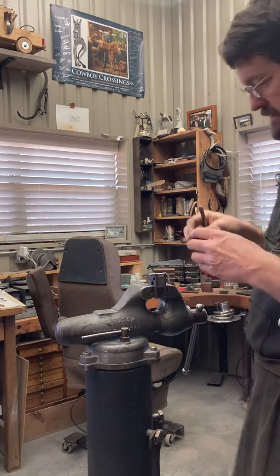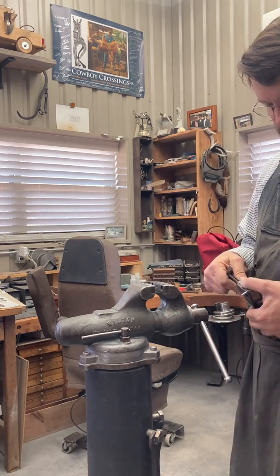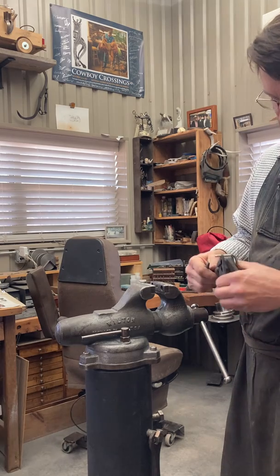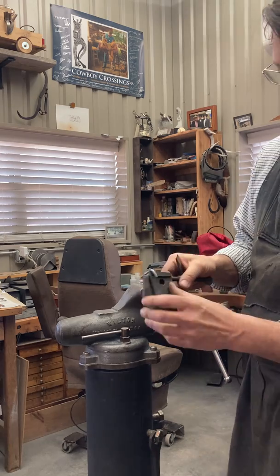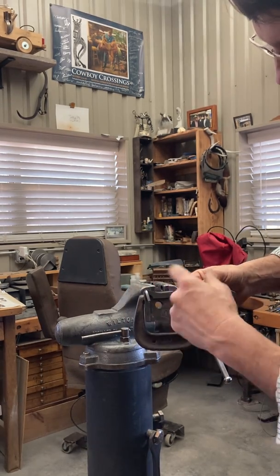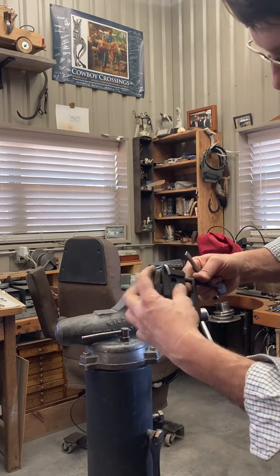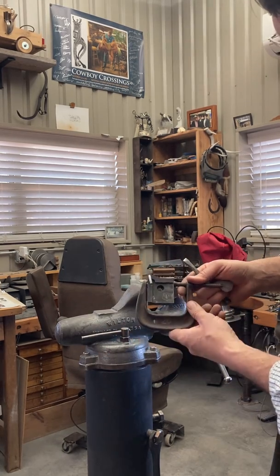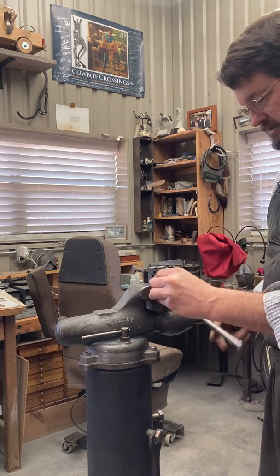And then, probably want to take this out because I got a big old clamp here. This big old clamp, I'm going to put on like so. What that does is, this C-clamp is going to hold this piece up against here because we're going to bend this around like that. So that kind of holds it in place. And as we get this bent around, of course, we're going to take the clamp off to complete our bend. But that holds this strap in place.